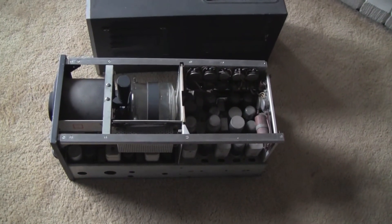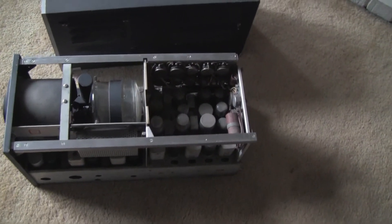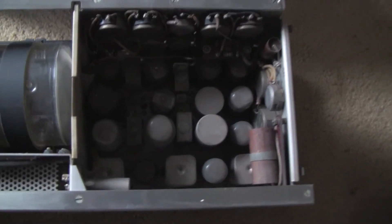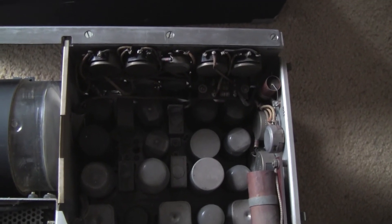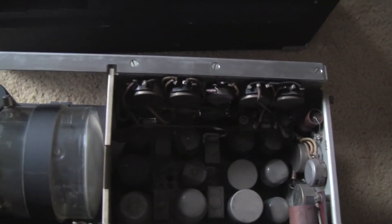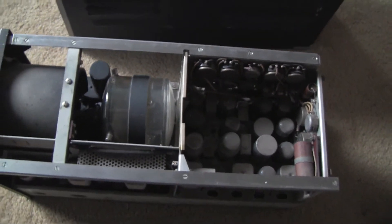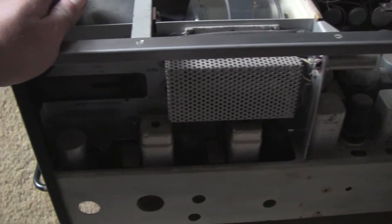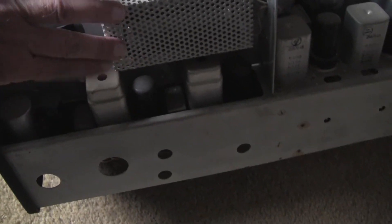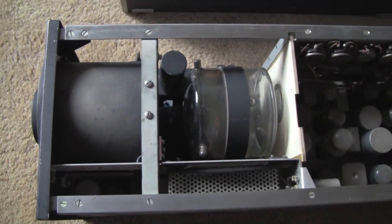The CRV 59AAE RCA bomb cam contains many vacuum tubes — we can see a few of them down in here. The circuitry in this is not as stable as one would build for broadcast, since the operational lifespan of the device was probably measurable in minutes. There was also a heater for the tube to defrost it, because the airplane could get very cold inside.